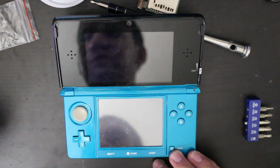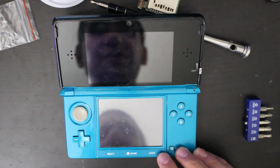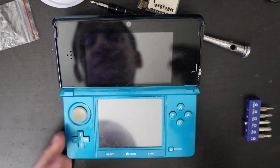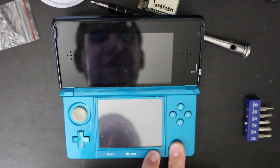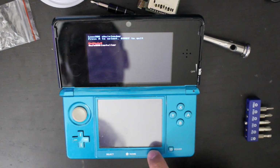This will be kind of my conclusive thing on here, and if nothing changes, this will just be the end of the video. But what I did was I popped in the 32 gig SD card with everything transferred over. I just did a copy paste from my old SD card to the desktop, then desktop to the new one. Again, I hold start power, which brings up all the Luma 3DS stuff.